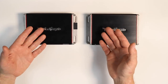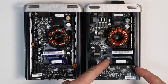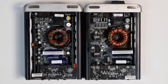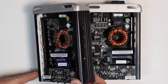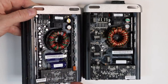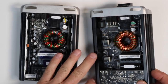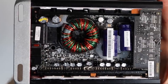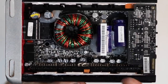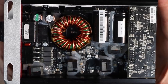Looking inside, the capacitors on the 400 are definitely bigger than on the 300 — the 300 has 2200µF caps while the 400 has 3300µF. On the 300 there's a lot more going on along the sides of the board, whereas on the 400 it's concentrated in one clean area — the other side is perfectly clean. The 300 has a much busier layout; the 400 is just a much cleaner design overall.